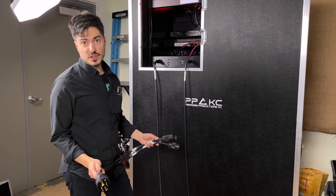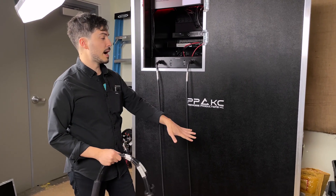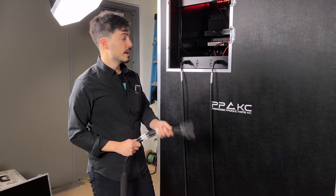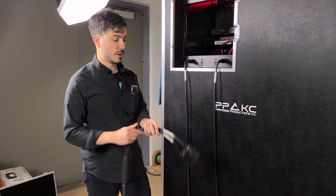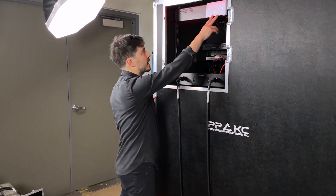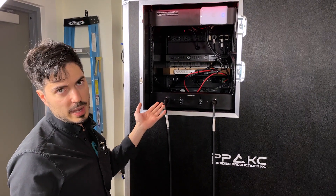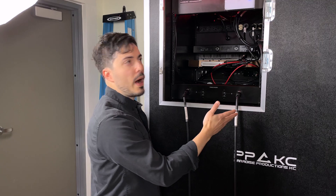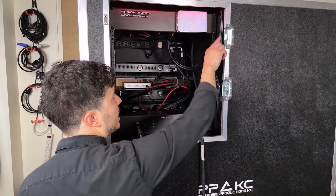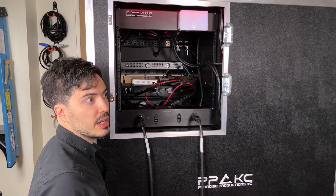If you're looking at this cable, any electricians in the audience are saying this should be a twist-lock connector. One of the reasons we're not using that is we want to just have the same power cables. But as a safety feature, we have 20-amp breakers so that if you draw more than this particular plug is rated for, you're protecting that with the 20-amp breaker. Looking back on the back portion of the rack, we have our access point back here. We have the Wi-Fi name and password so that if you are deploying this into a show site, you can just take a look at the back of the rack — it's out of sight, but it's there. Every wire in this case is custom cut per length, and the LED lighting is all in shielded cable so that you're not going to get any interference if it's running adjacent to any Ethernet line or power line.